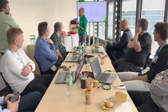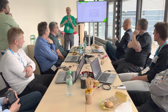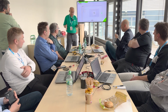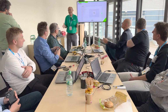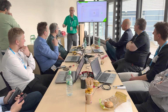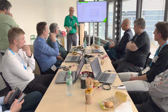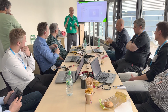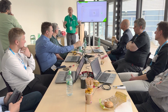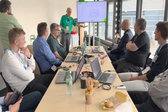Then you can go into production with the profile. You just take the XBee, squirt the profile onto it, and have all the files, the right firmware version, the right settings, everything you need in a single step. And we actually make a programming device, and they're daisy chainable, so you're not limited to 6. But if you buy a single device, you can just pop XBees in, and it's made for manufacturing. You pop the XBee in, it has a green light, it goes red while it's programming it, it goes green again, that means it's successful, you pull it out. So an operator can run this with really no knowledge of what's going on under the hood, making it easy to manufacture. That's the production side, not the prototyping side of the world.